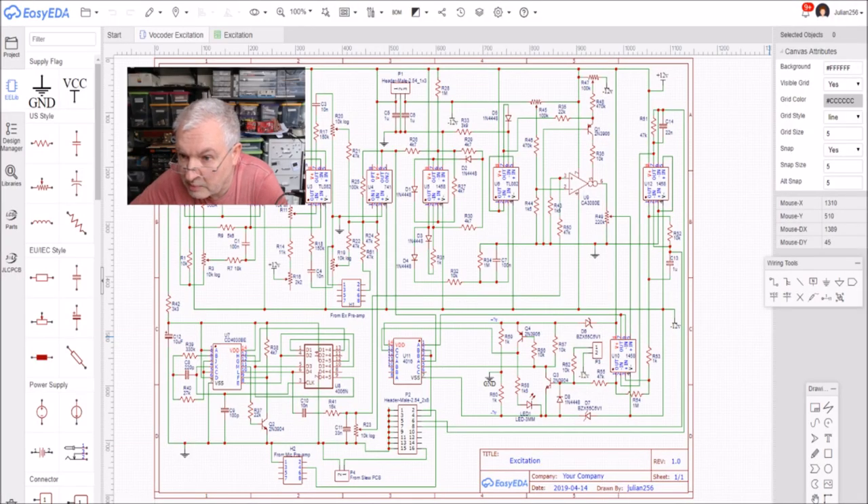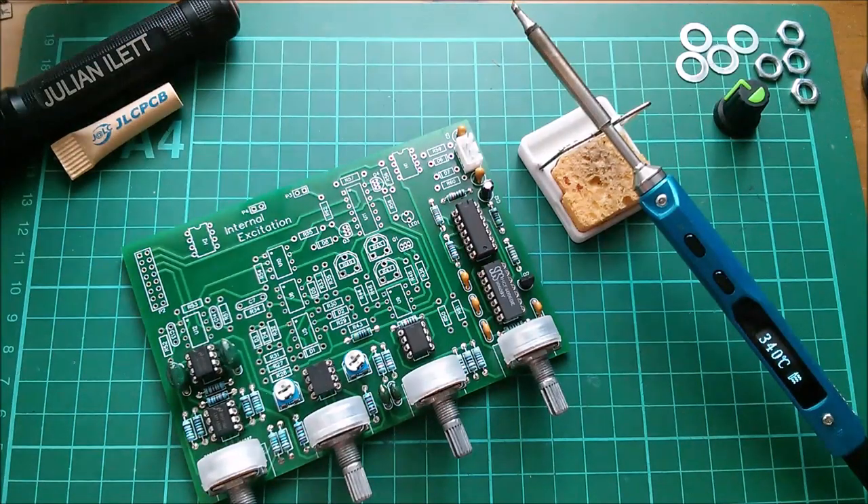The mixer is this 741 op-amp U4. R25 is 100k — that's the feedback resistor from input to output. It's got a gain of two because the input resistors are all 47k. There's a 4k7 resistor here, R26, which moves on to the next stage from the output — that's where I'm going to pick off my signal. I think that's everything needed.